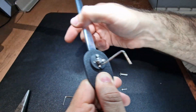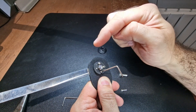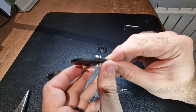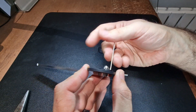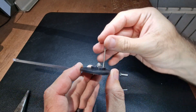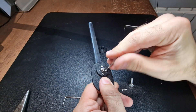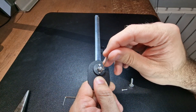Can you guys hear that? That ball detent is now hitting the ball track — that is it. We stop with that one and do the same again with the second. We can get really close and should feel a good solid click. Now if you want to keep tuning, you can take a little quarter turn and keep tightening it up.